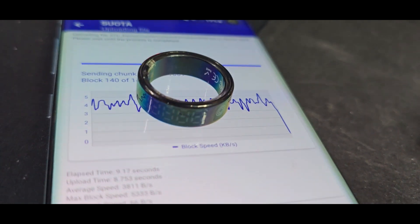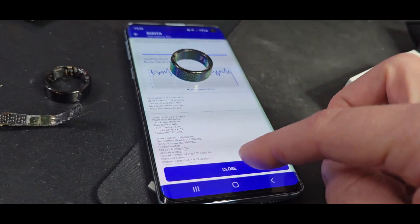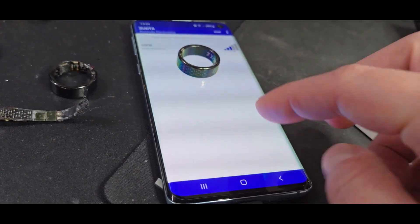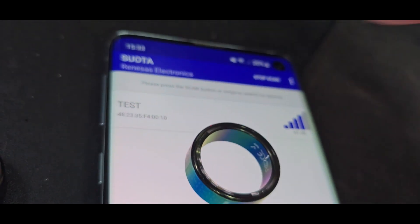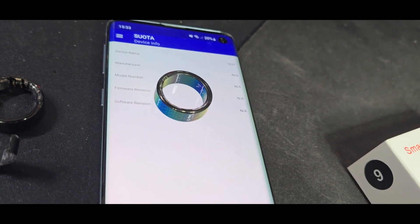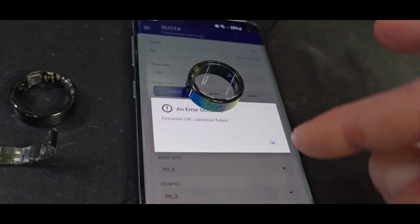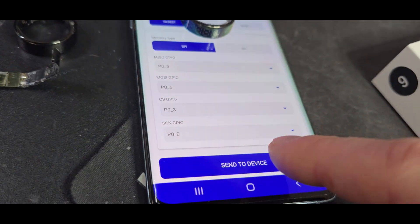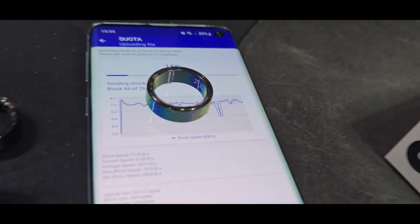The custom firmware is prepared for much of this stuff, but really just the basics. You can go back and rescan — a new device will pop up called 'test' with a fixed MAC address; that's the custom firmware running. If we click update, we can just select the stock firmware again. It will notify about the CRC again — just ignore it.